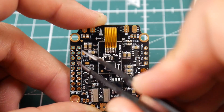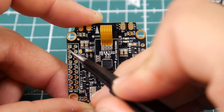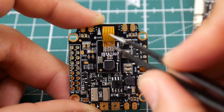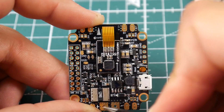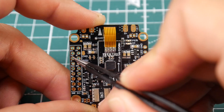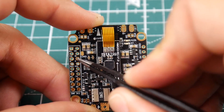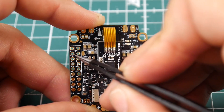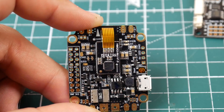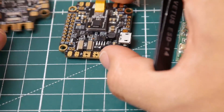What's nice here is they have a 'B+' pad, which means battery voltage plus, for the VTX power. If you're not sure, you can check the specifications or just run the positive wire directly to the battery positive. VO is video out - that yellow wire goes to your VTX - and always ground the VTX next to your camera to reduce video feed problems; you can even wrap them together and solder them in one place. So the camera yellow wire goes to video in, passes through the OSD chip, pops out to video out which goes to your VTX, and transmits down to your goggles because this board has an OSD.